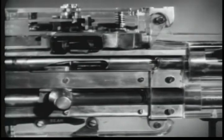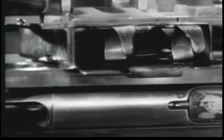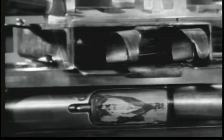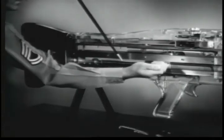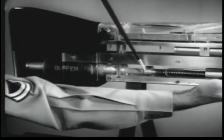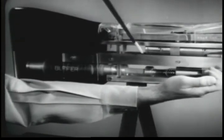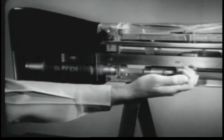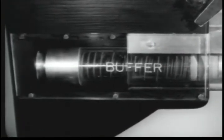Extracting and ejecting now begin. The empty cartridge case gripped by the extractor is drawn from the chamber. The ejector on the other side of the bolt was compressed during chambering and exerts forward pressure on the rim of the cartridge. When the empty case reaches the ejection port in the right side of the receiver, the ejector spins the case from the gun. Ejection is completed. The next round pushes out the link. The firing pin spring is compressed and cocking is accomplished. The operating rod drive spring is compressed. The operating rod drive spring guide is in contact with the buffer plunger. The moving operating rod compresses the spring against the head of the operating rod drive spring guide. The buffer plunger forces the buffer pads rearward against the buffer return springs. The pads and springs absorb the rearward energy and the cycle has been completed.